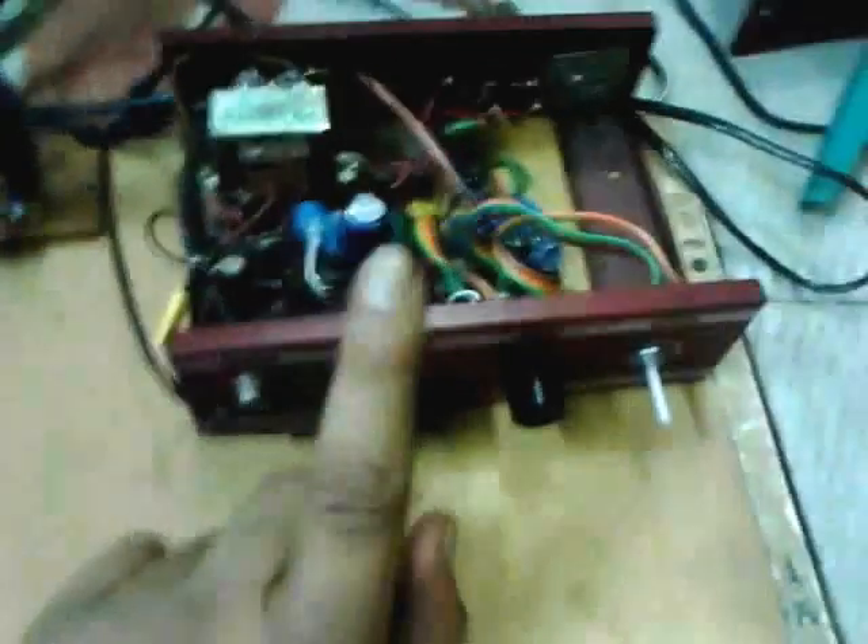The output from this source goes to a three-band equalizer. As you can see, I assembled this on a Vero board — I used an NE5532 with this. And the output of the source goes to a preamplifier.